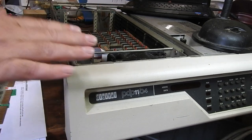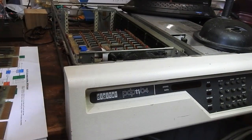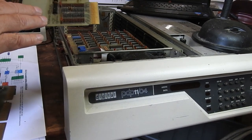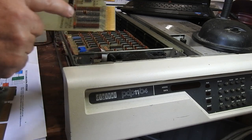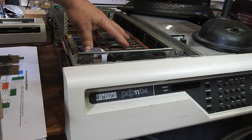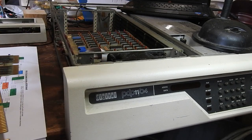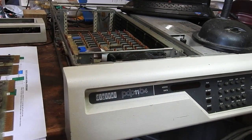Just a quick recap. Because I have a PDP-1134 as well, which uses the same console and console interface card, it was easy to determine that there was a problem with this board and in fact the Terminator card as well. Fixed the problem there, fixed the problem here, although another one developed that I don't think is related to my repair. There was just a broken trace, a hairline crack, and then this chip blew up. So I'm using the good one out of the PDP-1134 here. The problem's still on this board. The one from the 34 is okay, from the 04 it's not. They both have an 8008 microprocessor and swapping that makes no difference, so those are both good. There's a problem on that board still. I found one fault which I've fixed; I didn't think it would cause the symptoms I was getting on the console, and fixing that didn't help.